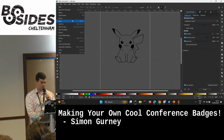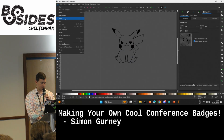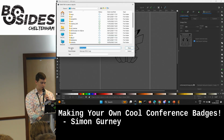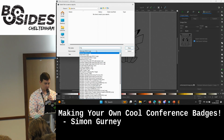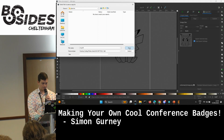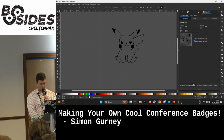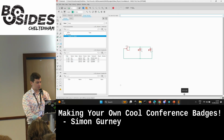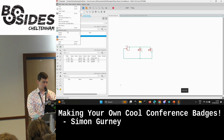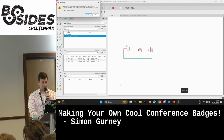So once you've got Pikachu, we save him out. Okay, so it needs to be a DXF format. Okay, so we're back into Eagle now. And what we want to do is bring Pikachu in, because Pikachu is going to be our board. So we're going to switch to the board view, which is this button up here.